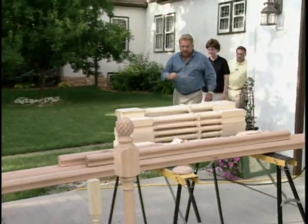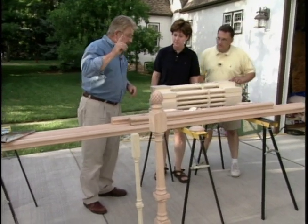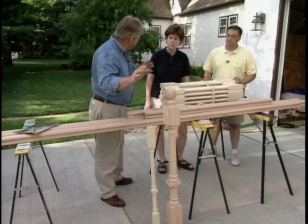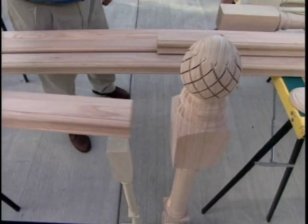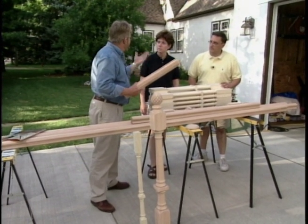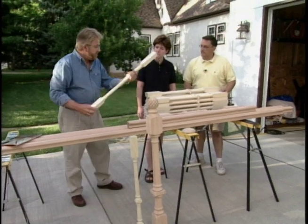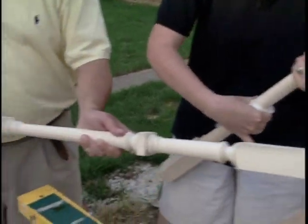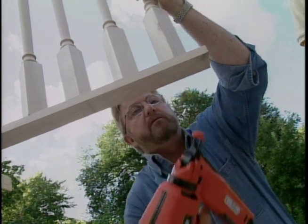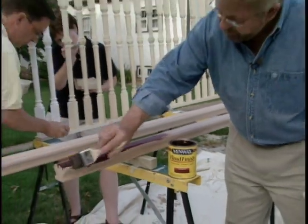I've laid out all the components for our railing system right here. There are really only three. This is a system by American Legacy. The three major components are a newel post, newel posts will go at the top of the stairs and at the corner, a series of balusters in between, and the whole thing is connected together with the railing. The newel post and the railing are in oak, because you guys have got a lot of oak in the house. The balusters are actually in poplar, and these are designed to be painted. As Steve and Stacey clean the dust off each piece, I temporarily nail the balusters to a strip of lumber so we can turn our painting into an assembly line operation. As the couple get started on the balusters, I begin staining and finishing the oak railing.